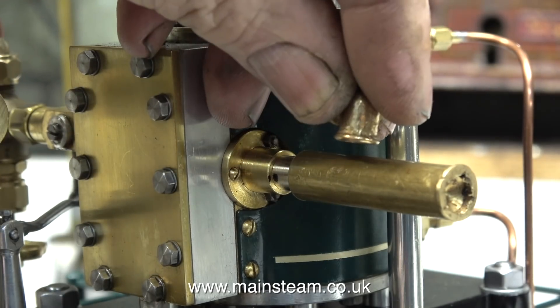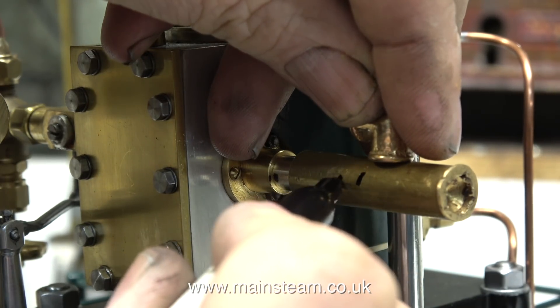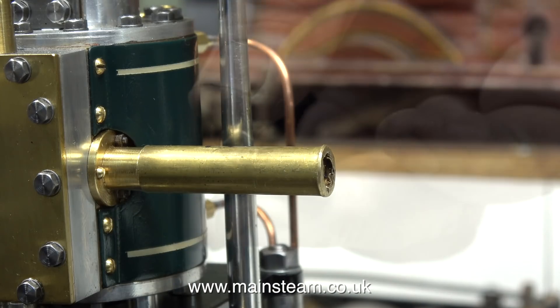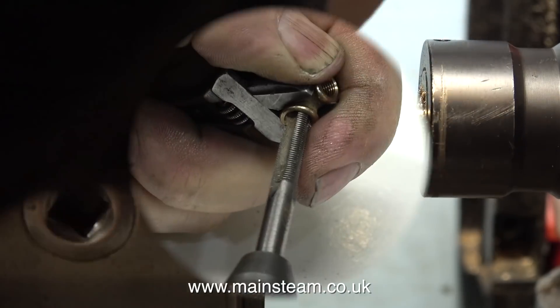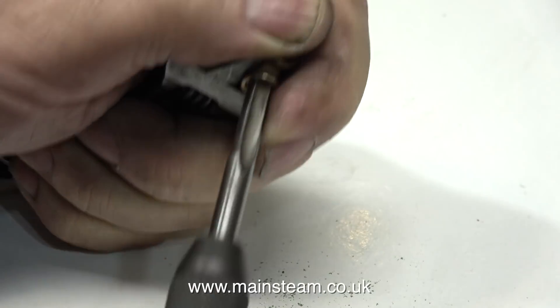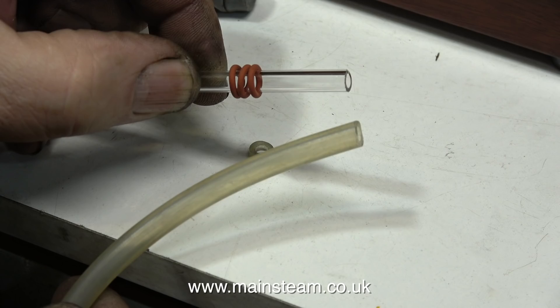At this stage, I need to shorten the part I've just made so it fits flush against the original cylinder fitting, and then I will shorten the entire adapter so that the elbow points the pipe exactly between the engine and the back of the flywheel. I completed the machining and threaded the end of it a quarter by 40 threads per inch. And then, as usual, I had to re-thread the elbows — I always have to do this; I think the pitch is slightly wrong. I need my new adapter to seal in the existing fitting, so I decided to use a piece of silicone rubber tubing.